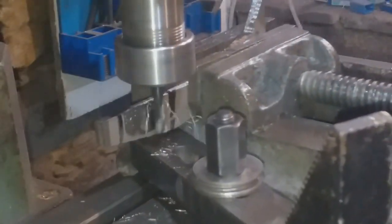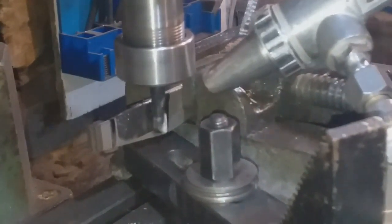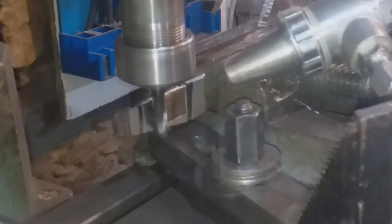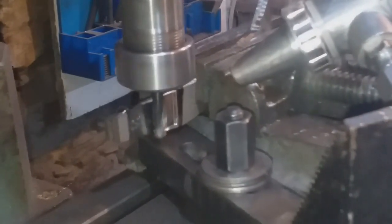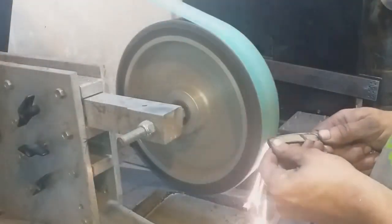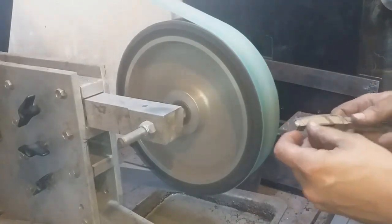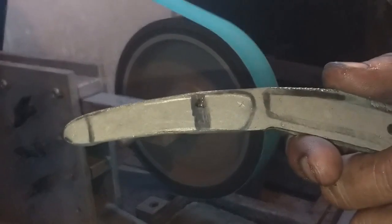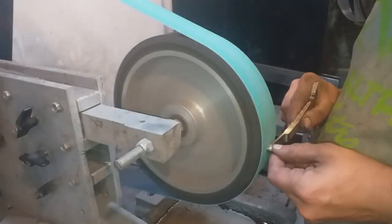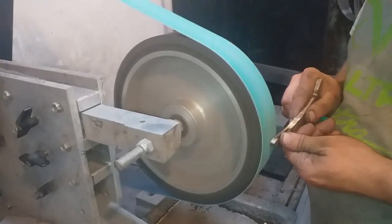Here you can see I'm back on the milling machine again, and I'm actually relieving the excess material from within the pocket clip. Then back over to the grinder to profile around the edge of the pocket clip. It worked out fairly well that I could leave the backspacer and pocket clip attached together whilst grinding this, so I had a little bit of a handle to hold. I then flipped it around and started profiling the backspacer.